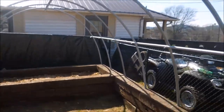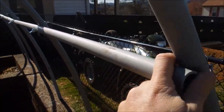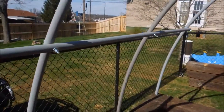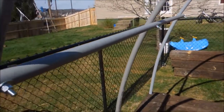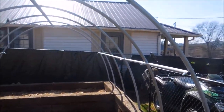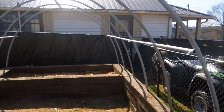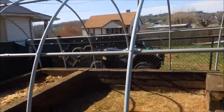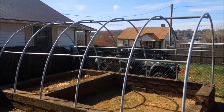So we've got a ridge pole in the center, and then I put two side supports in using the one-inch pipe — same method, two sticks put together, cut to length, spaced and marked, bored a hole, and a three-eighths carriage bolt on both sides. Super simple construction. If you've got a drill, a hammer, and a socket set or a wrench, you can build this hoop house. It's super easy, and in theory it should hold up to anything and last.